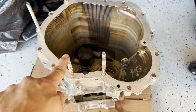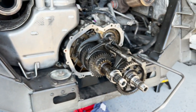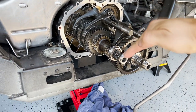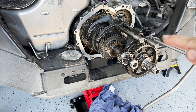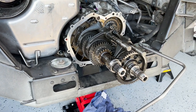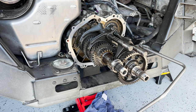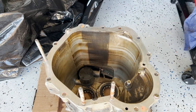I had to jack up the transmission a little higher so it was angled, because essentially I was jacking up the entire engine. Luckily the mounts were flexible enough to allow me to angle the engine and extract this transmission housing. Once the housing was off, I jacked it back down to an even level to reduce stress on the engine mounts. This is probably the hardest part of the manual conversion — it was a real bear to get out, especially since this was my first time dealing with this type of transmission housing.